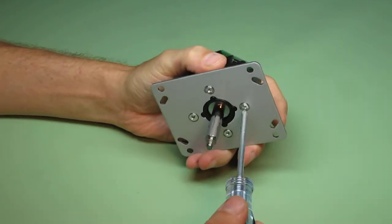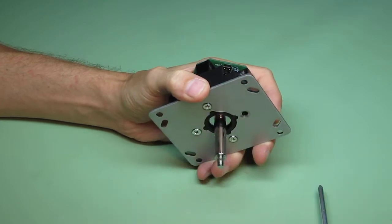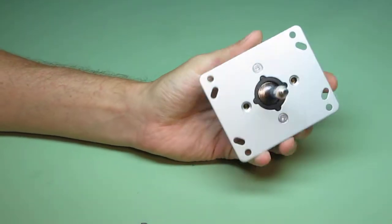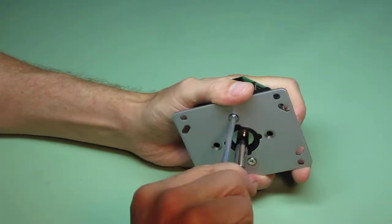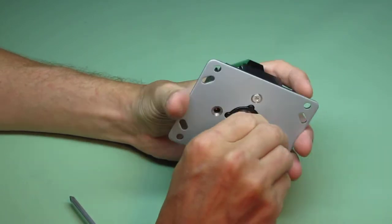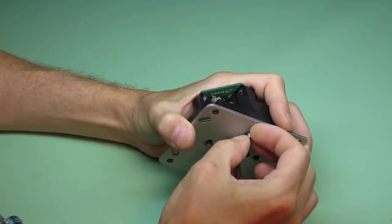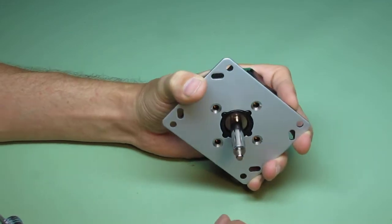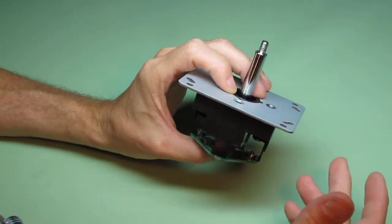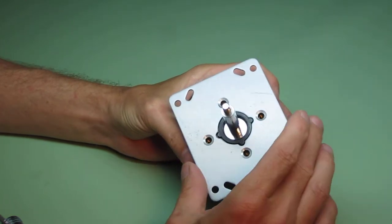Okay, so first there are these 4 screws here, which we'll take apart. Now, the thing that makes this joystick really quite unique, as you've seen, is this circuit board on the bottom. The circuit board is what allows the joystick to be programmed into any one of a number of different configurations, as, for example, a 4-way joystick, an 8-way joystick, a 2-way joystick, and this is all set in software. The joystick plays very nicely with front ends like GameEX and Hyperspin and utilities like LED Blinky, etc. So when the game launches, for example, if you launch Defender, the joystick will go to a 2-way joystick up and down. So it's a really fantastic joystick in the way that it operates, I have to say.